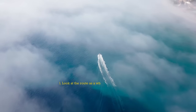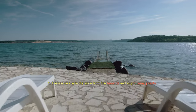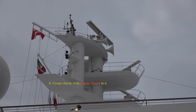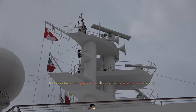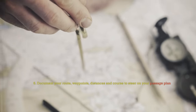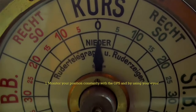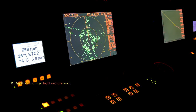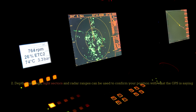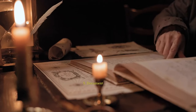Route planning tips: 1. Look at the route as a whole and identify any hazards. 2. Decide on a safe distance from the hazards and any turning points. 3. Plot the intended route on the chart screen using the cursor. 4. Cross-check with paper charts to ensure safe distances are okay. 5. Note the minimum XTE on individual legs. 6. Document your route, waypoints, distances, and course to steer on your passage plan. While underway: 1. Monitor your position constantly with the GPS and by using your eyes. 2. Depth soundings, light sectors, and radar ranges can be used to confirm your position with what the GPS is saying. 3. Monitor your XTE. 4. Monitor your time, speed, and distance. 5. Document in your log.